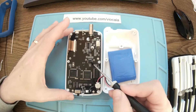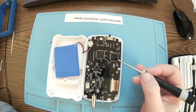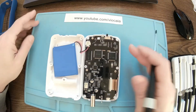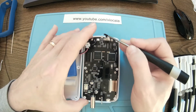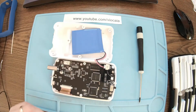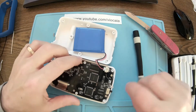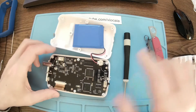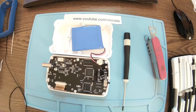The analog-to-digital converter is here. And here we have the ARM processor — it's an STM32 F103, we'll see that better in the photos. There's a small memory chip I think is for photos. Over here we have some silicone — I'm pretty sure this is for charging the battery. Let me take that off to investigate. Yes, of course: TP4056, that's the lithium battery charger, and I think the silicone was there on purpose for cooling the circuit.